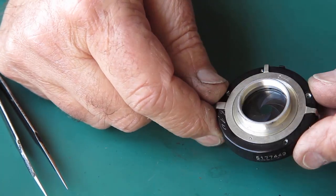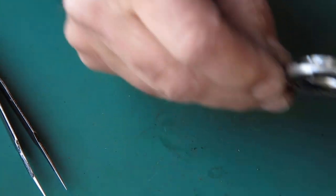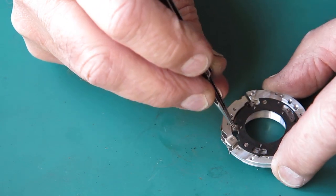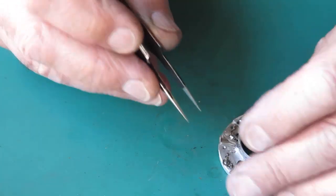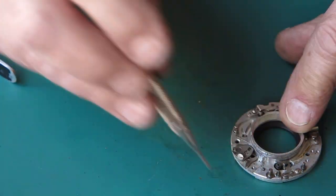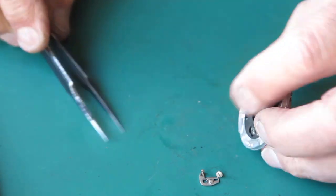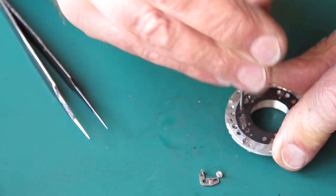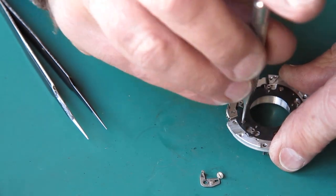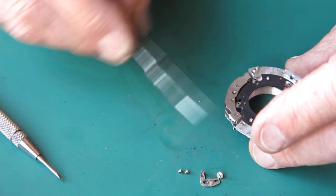Here's our mechanism plate and the blades, and here's our shutter case and the diaphragm — and that is pretty grimy. It does not move smoothly. It's not the worst case I've seen by a long shot, but it is sticky, so all of that's got to come out and be cleaned. Our mechanism plate — just tip those blades off and see if that mechanism moves. That's very sticky, it only just oozes back into the rest position. All this is very dirty and all of it needs to come apart and be cleaned. Three screws hold this retainer in place — two short ones and a long one probably. We've got three short ones today, which is easier when they're all the same size.